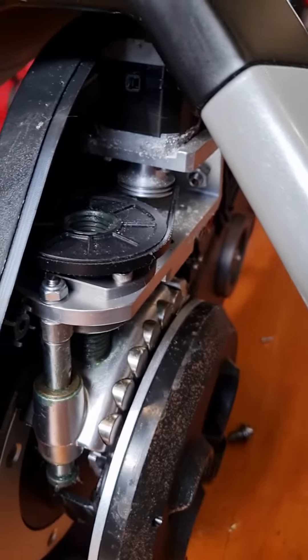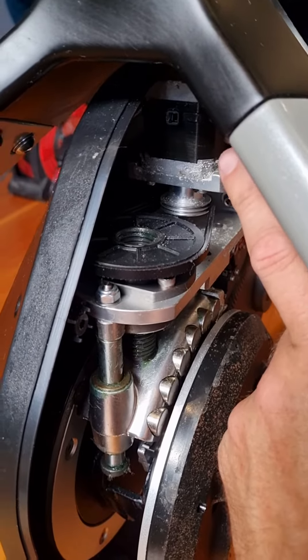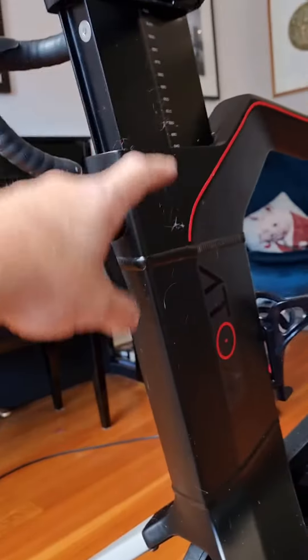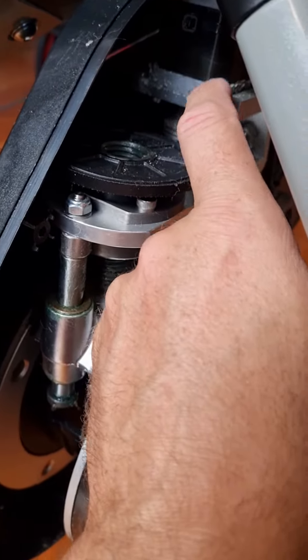So now you'll probably find that this stepper motor will actually work, and if you put the bike on, the resistance will actually work. But it's all the corrosion and the salt and the acid and the sweat that dribbles down the handlebar column, down through here, or down on the covers, and then down into here, and drips down onto here — which you can see all the corrosion we've got here — plus the salt in the sweat that's in the bottom of the machine.